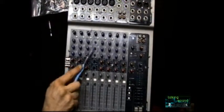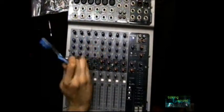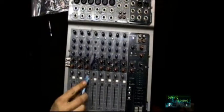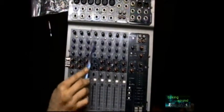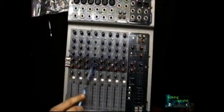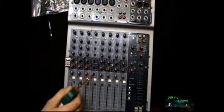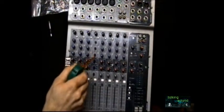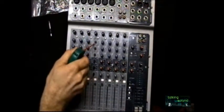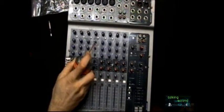Once we've done our typical 25 repetitions and we're done with the input, we want to come in and get a little bit of surface cleaning done — making sure we get inside and up around these pots. What happens is right where all of this is obscured, dust will start to collect and attract more through an electrostatic charge. So believe it or not, underneath your knobs, potentiometers, and faders gets absolutely filthy. Once we have a decent scrubbing done we then come in and give each one a quick blast with the air duster to clear any dust right inside.